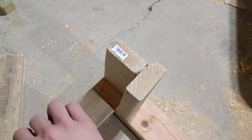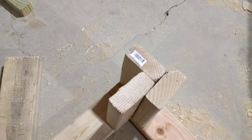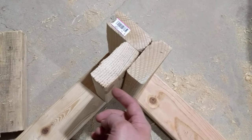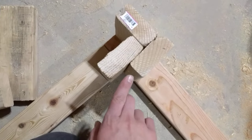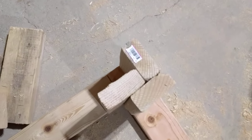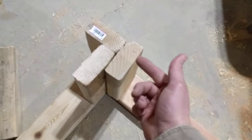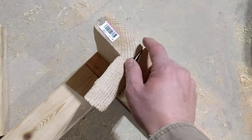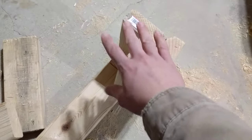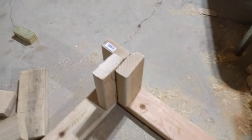Your best bet is going to be to use three studs and anchor them together in this pattern right here. Now you can see we've got a backer here to anchor our sheetrock to. We've got a backer here. Same thing here. External corner, we have a place to anchor both sides. And the beauty of this is if you want to drill and pull wire through here, you just drill straight through this stud and through this one, and you can pull your wire to where you're going. That is the best layout for how to frame a 2x4 stud wall corner.